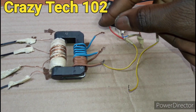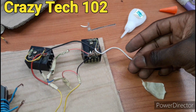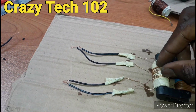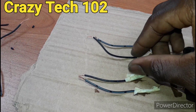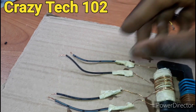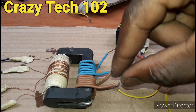So the two yellow wires are up here and down here guys. These are our positive and we have the negative here for the battery. And these are our outputs. For this middle output guys, we are putting a full bridge rectifier and a capacitor to get a DC output so that we can use this for a DC brushless fan. And these are our main outputs here — the up wire and the down wire.